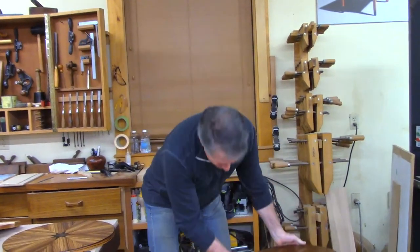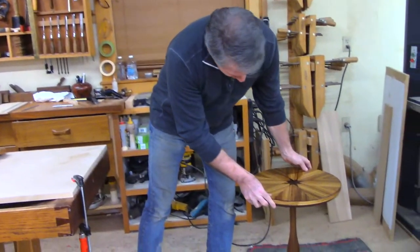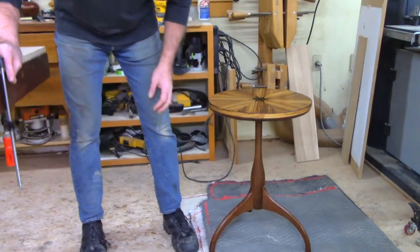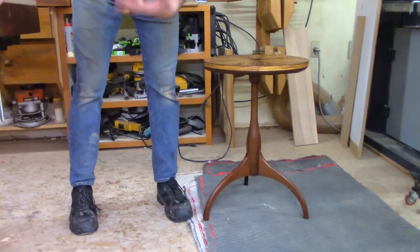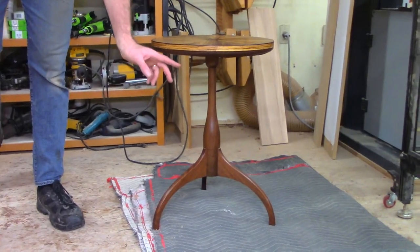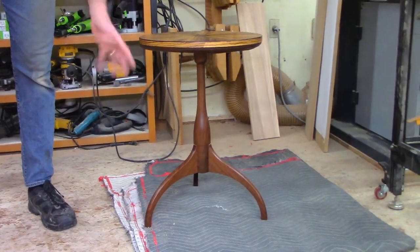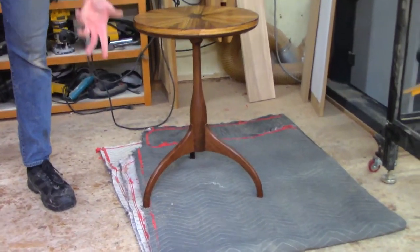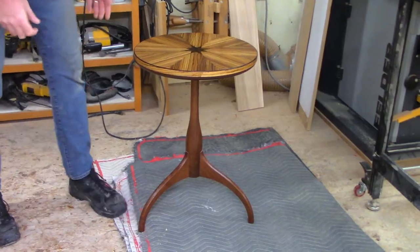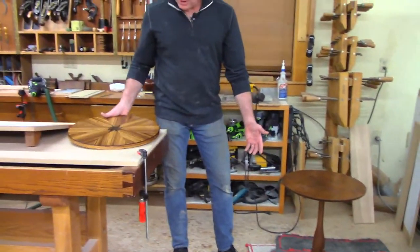It's a beautiful example of the integrity of joinery here — a sliding dovetail right up into the column, then a wedged tenon on top of the cleat. The cleat gives a sculptural effect and gets thin toward the outside so you barely see it from the top. This is a nice example of where the shaker style really hits the home run as far as overall composition. I'm looking at this thinking about a table base — but a period base with a contemporary top feels like a mismatch.